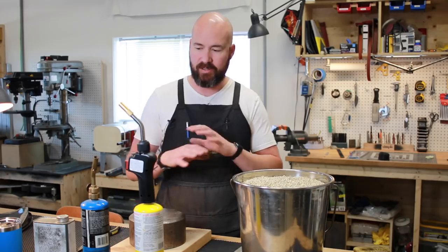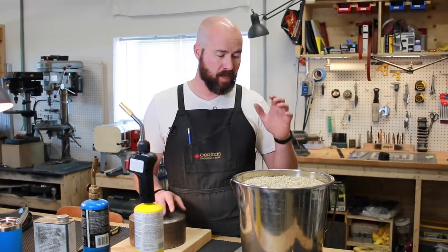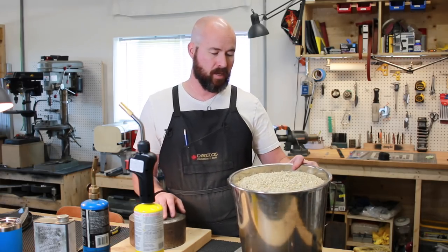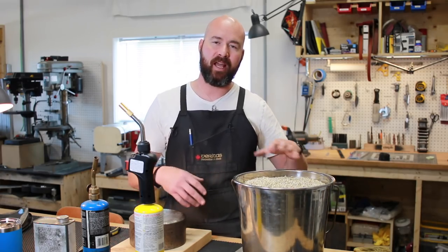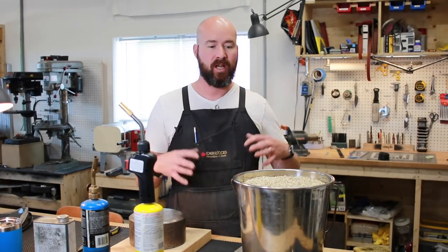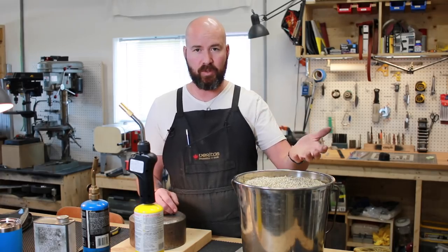To keep this really easy — all stuff you can find at your local hardware store or gardening centers — I'm going to try cooling it down in vermiculite. I've never tried that before. Vermiculite is used in gardening; it keeps soil airy for plants that really like a lot of drainage with very light airy soil. Perlite is also another product.